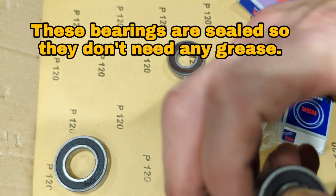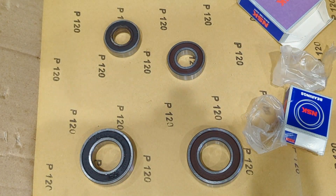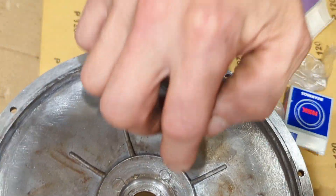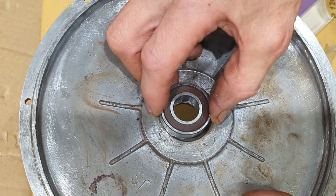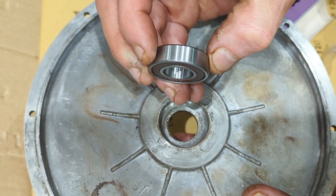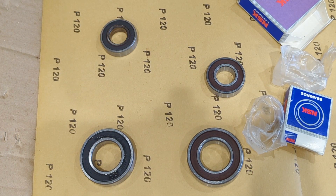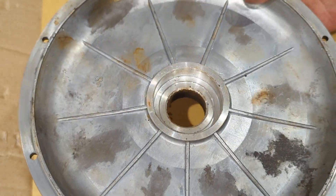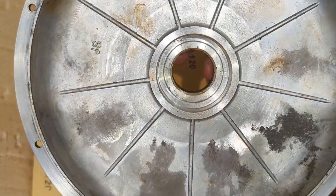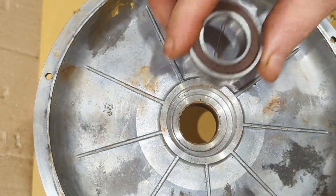But the old one — that is one wicked. I just thought I'd show you that. I haven't finished cleaning out the inside of this yet so I won't be putting it in yet, but that one goes in there. That's 17mm in the middle and 35mm on the outside and it's 10mm deep. That goes on one side, and this is the wire side of the hub, which is why the central spindle is actually 25mm rather than 17mm. That's 12mm deep and that will go in there.